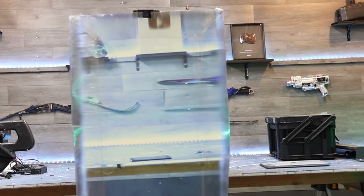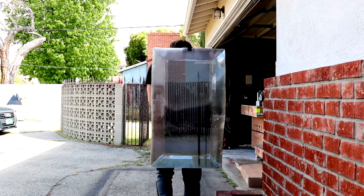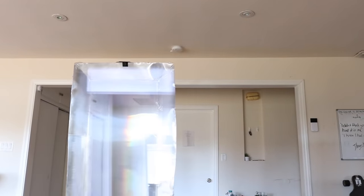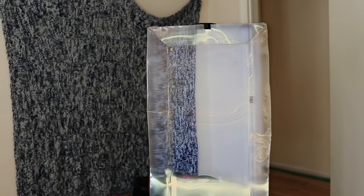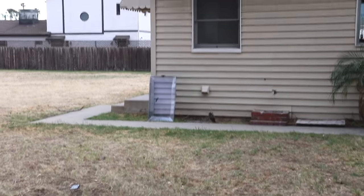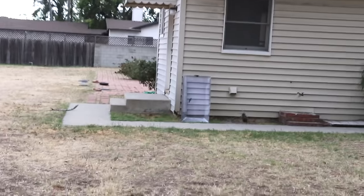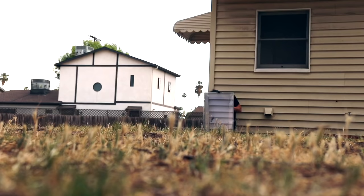So as you can see, it's kind of convincing. It works best with slow movements and medium lighting conditions — if it's too bright the screen gets washed out, and if you move too fast the tracking program can't keep up and the image lags. But when it does work — oh, it's super cool. No green screens, no nothing. I'd say it's like 90% invisibility. Kind of looks like you're looking through glass. Comparing it to the plain lenticular lens, I think it's better, especially up close. But even from far away, with all the software and tracking algorithm turned off, it still acts like dynamic camo — like a chameleon, giving the same colors as the background.